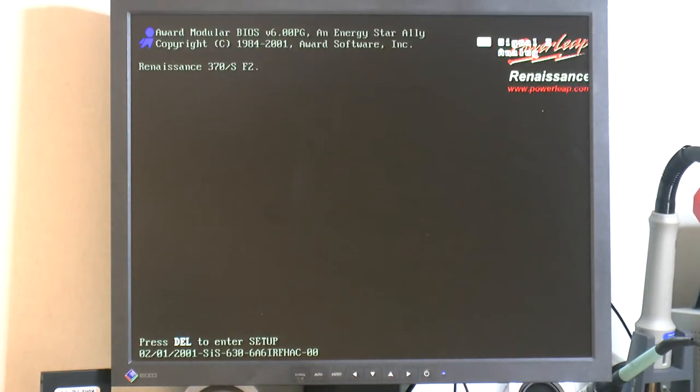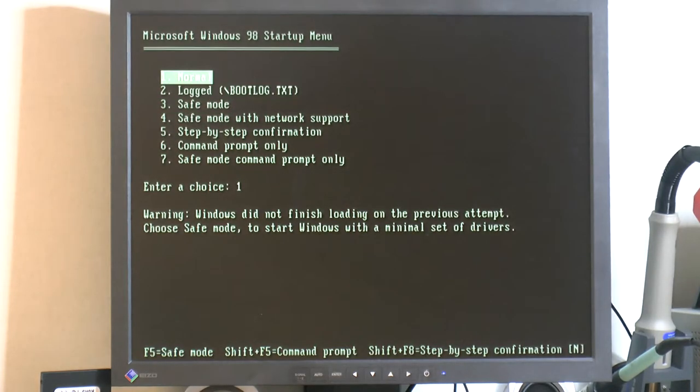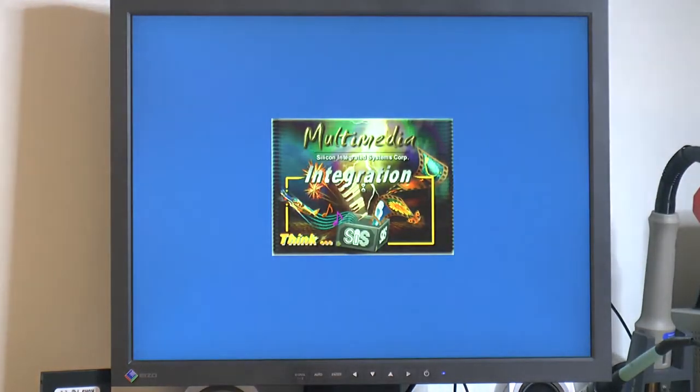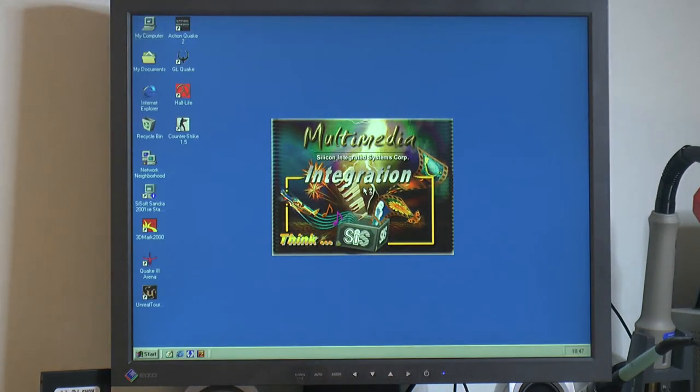Though it does run CAS 2, and the subtimings are 2-2-4, and some other timings are set to the lowest, so it's as fast as it gets. I ran Memtest86 on it. It helps a lot with the performance though, manually tuning it actually. I think the 133 setting was on average 208 megabytes per second, and the 100 MHz setting was 218 megabytes per second, and with everything tuned manually to the lowest timings, I'm at 248 megabytes per second, and that is reflected in actual performance in benchmarks and games.